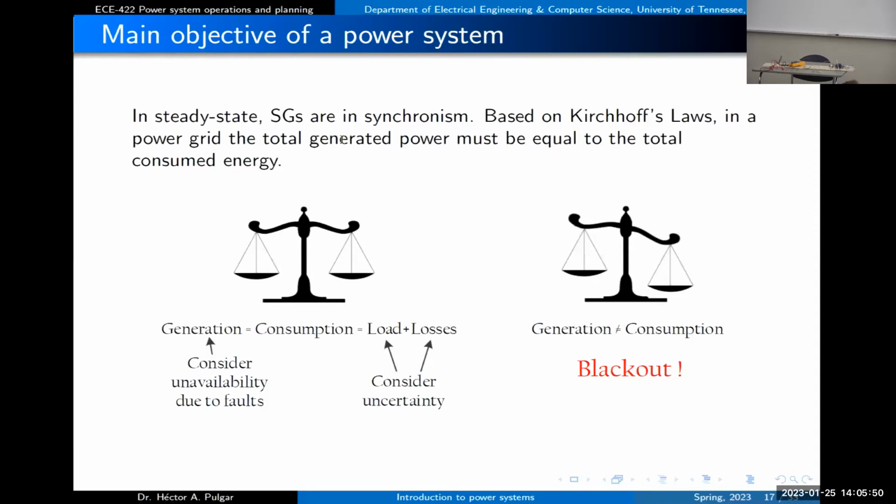Yeah. So are the interconnections of the power grid totally isolated, or are there components where, say, one interconnection is suffering from a blackout, but another interconnection is helping out, or is every interconnection completely separate? So good question. We have three interconnections in the country: the Eastern interconnection, Western interconnection, and Texas interconnection. And we do have a connection between them, but it's not with high power. There's a little power exchange. So if something happens in one interconnection, there is no way that the other interconnection can help.